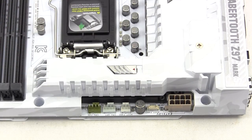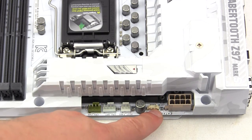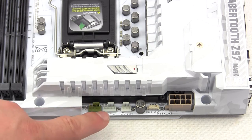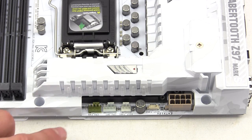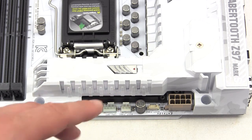On the top side of the motherboard, a lot of connections are kind of hidden. We have our eight-pin EPS connector, a small fan header for the optional top fan, a three-pin fan connector, a CPU optional fan connector, and our CPU fan connector — denoted in green for your main CPU fan. If you have two fans on your cooler and want to control them independently, you also have the optional CPU fan header. Both are four-pin headers.